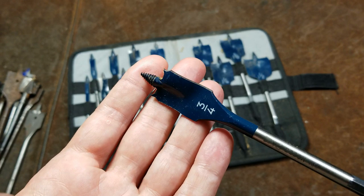I'm going to take this 3/4-inch bit — I haven't used it much — and show the difference in drilling at three different RPMs: 1,000, 2,500, and 4,000 RPM. Spade bits are designed to be cost-effective, so the shanks won't always be perfectly straight, but on these Bosch units they have been pretty good.